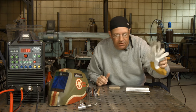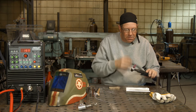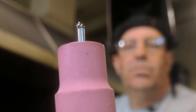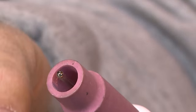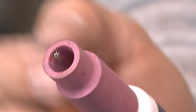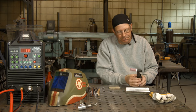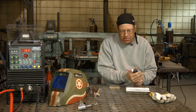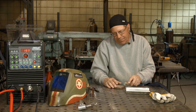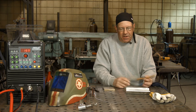I went ahead and put my gloves on — the camera guy likes me to be safe. We balled up a tungsten using DCEP, reverse polarity. I did a little test weld and it's the old school 60 hertz — broad arc and everything. Didn't get enough amperage to reshape the ball and it made the weld pool pull. That's how we did it in the old times and it's still cool to go back and do that. Aluminum creates its own difficulties because of the physical properties of dissipating heat and the aluminum oxide layer and all that.